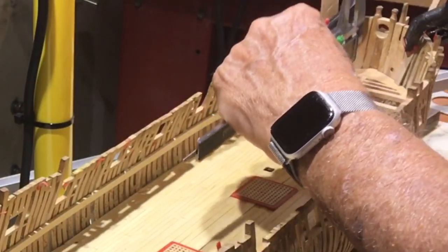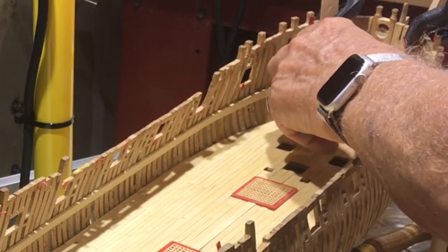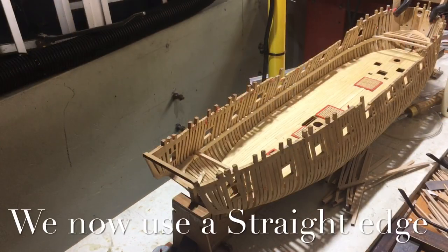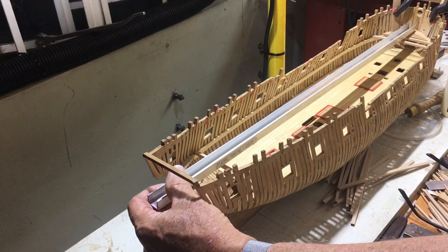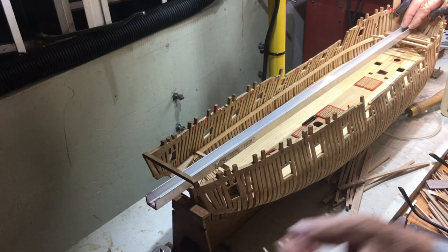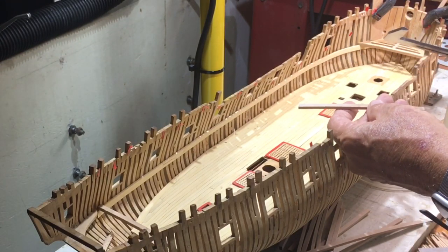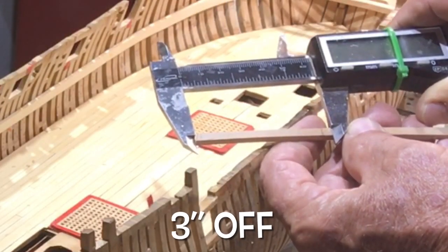To establish the center point, first we put it in place using the caliper — I've marked it out so I don't have to keep repositioning it. We want to make sure the center point on the beam is not established by a protractor but by the real center. So I'm lining it up, and here is the center line — the straight edge which we're lining up with the stern post, the mark on the transom. Why that mark is important: last time we just found the center line of the beam, but here we've taken a measurement off one side. Look at the difference — had I used my old method I would be in big trouble.